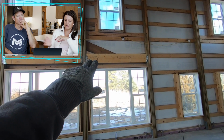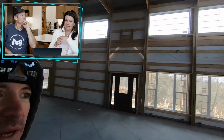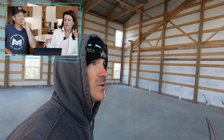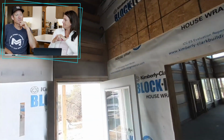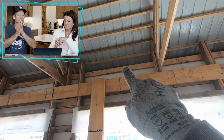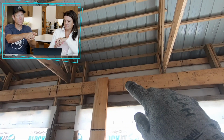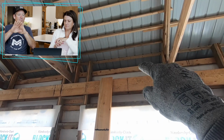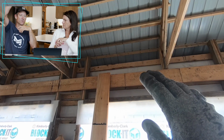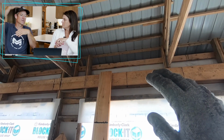You just did a house where the client did spray foam on the roof and everything. How do you feel like that compared, prep wise? Would you say that's easier? The only real difference, there's a couple things I had to do differently. Where I take, I'm going to show you what I'm going to do. I'm going to take 1/2-inch plywood and put it up in the soffit, leave like a 2-inch gap so air can come through the vented soffit and flow up. Where I just ran it all the way to the ceiling.